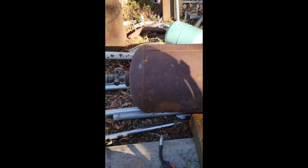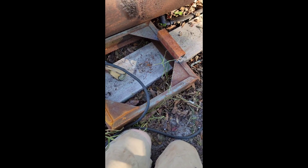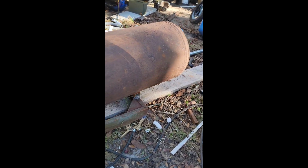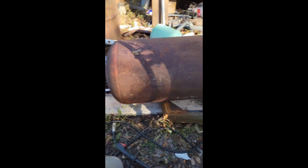Super simple wood-burning heater — here we go. Step one: the base. Step two: weld the tank on the base. Notice the slight angle with the backside going up a little bit. Weld the tank on the base.